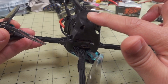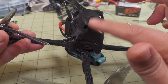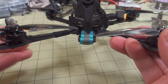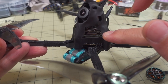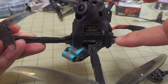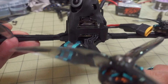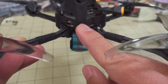BF-PB did send me the canopy and this little piece down here. If you're going to do an analog conversion, you just need the top part. But if you're going to do the DJI conversion with the Vista, you need the bottom part and the top part. The Vista actually screws into the canopy — it's hanging from the canopy via two M2 screws. Then you use three screws into the canopy to this bottom part, and into the frame on the outer holes. You have two screws on the sides going top to bottom nut, and one in the front coming through the bottom piece into the canopy.